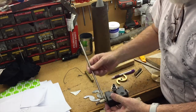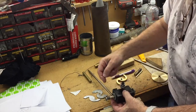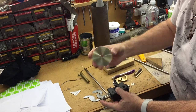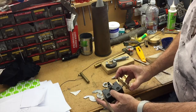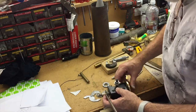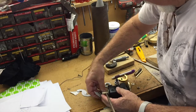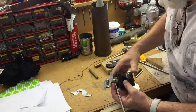These little holes allow me to rotate both the pattern and the work around inside this boring bar holder. It's just got a hole through the middle for a boring bar, and I'm using that as a means of holding both the work and the pattern. On this end, I take the nut off and place the blank discs I've prepared — there's a keyway, by the way, and a keyway on here too. So it goes on here with a key and a nut to hold it tight. The pattern goes on the other end, and you'll see in a minute how it's set up on the lathe.